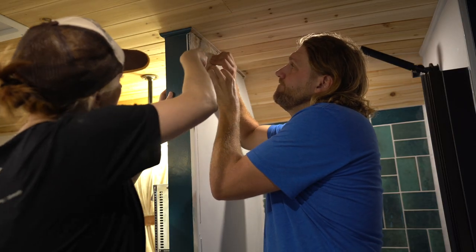Except it wasn't, because it's the shower and there's always at least one or two issues — it's cursed. After a few days we noticed on the left side the FRP was sort of peeling back a little bit and bubbling. At the edge at first, we thought we'd just pull it back, put some marine adhesive in there — it shouldn't be a problem. That looked good. Then after a few more days we noticed there were two pretty big bubbles right in the middle with really no way to fix the problem. The weather at our shop lately has been really up and down — very warm, then very cold at night. With all of these temperature changes, if there's air trapped behind the FRP board or some of the adhesive releases, the air will expand and form a bubble. It was heartbreaking, and immediately we knew we had to redo it. So we ripped the FRP down off the wall and got a new piece.